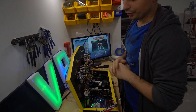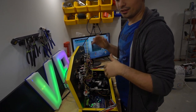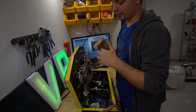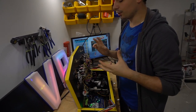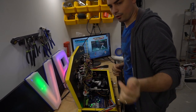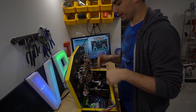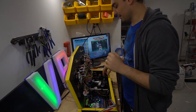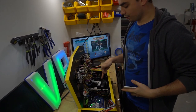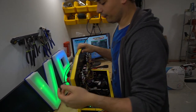We're back on Eugene's control panel and I can finally finish it today. I messaged the company and they gave me a suggestion. Turns out we had the wrong power supply — basically the wrong voltage. I originally had a 12-volt 5-amp going through it, and the company suggested a 12-volt 3-amp. Sure enough it came in and now it boots perfectly fine.